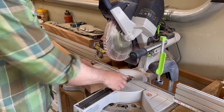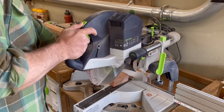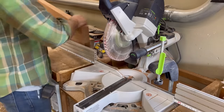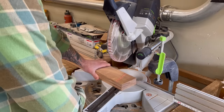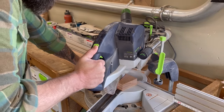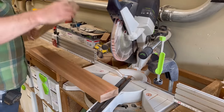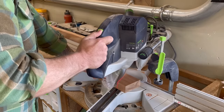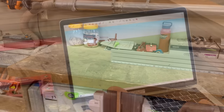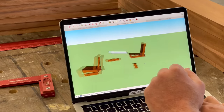With the lines drawn, you take it over to the miter saw, set your angle to match that line, and cut it. Because we're not cutting to length yet, I just take all my pieces and cut that same angle on the end of each one. Once I have the angle cut on the end of each piece, I flip my first piece over, change my angle on the miter saw to match the new line, and cut. This does cut our piece to length, so I then set up a stop block and use that as a reference to cut all three remaining pieces to that identical shape and angle. These are just one of multiple pieces needed to make up our seat frame. For the next set of pieces, I isolate them in SketchUp and square them off the same way — measuring over and down on top and bottom, transferring those measurements onto my square piece, and connecting the dots to get my angle.